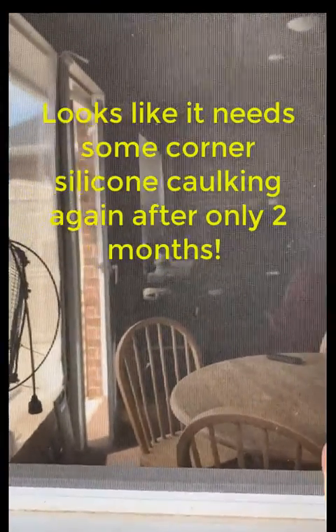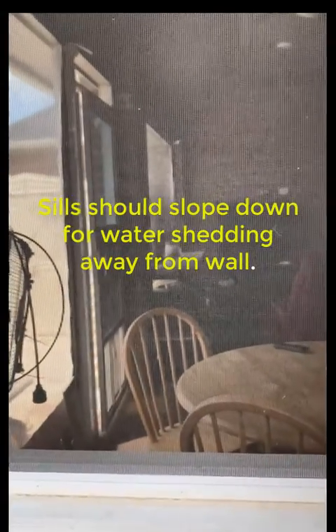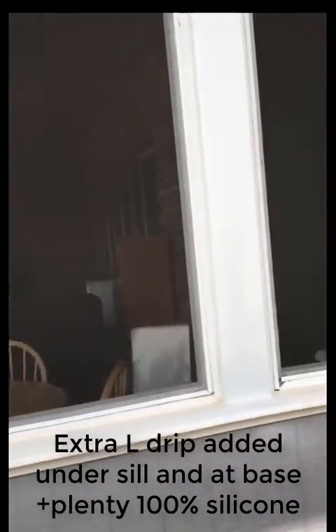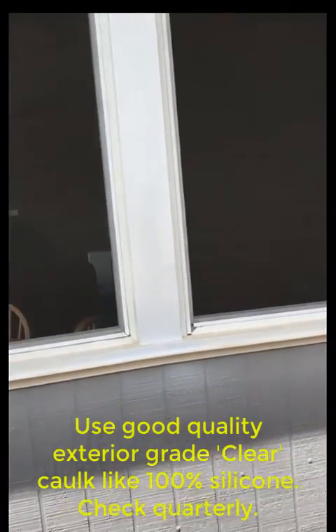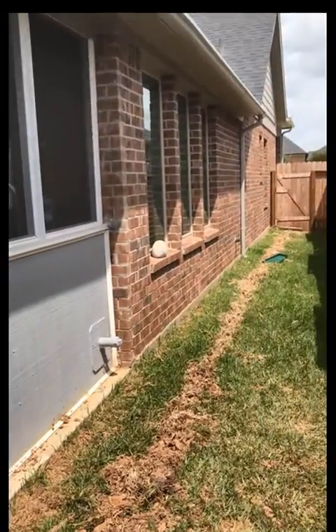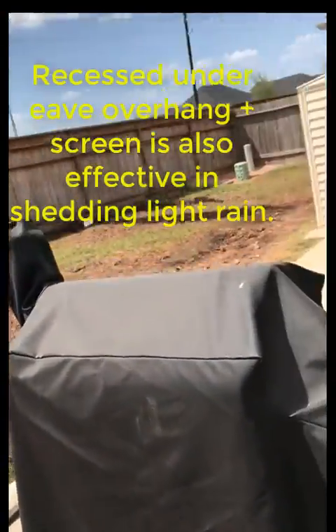Yes, for you experts, there is a vapor barrier inside here as well. It has a five-degree slope on the outside because I put shims underneath it — not plastic shims — so we get a downslope. I've also got an L-shaped piece underneath here, so I've got a double layer which should drip water clear of this surface. Even though it's well painted and caulked, we get adequate drip-away. Plus I've got a drip at the bottom to stop water coming underneath — it's doubly caulked on the bottom and sides. There's a little flap for access to my electrics for the pellet grill.